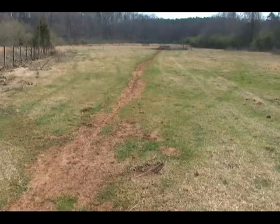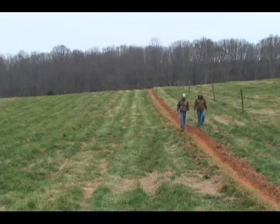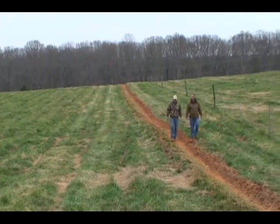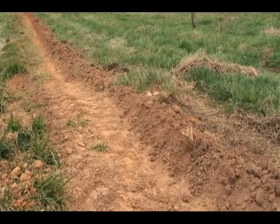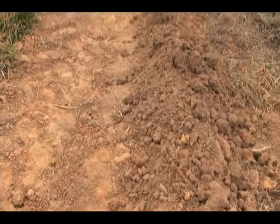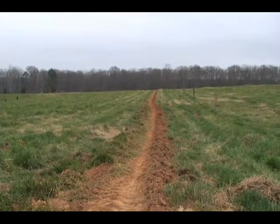It's also important to use the right material to backfill your pipeline trenches. Use mineral soils that have enough moisture so that they will compact tightly. There shouldn't be any large pieces of organic debris or manure, and any rock fragments should be small. You can crown the backfill material if you need to be sure there won't be a depression after the soil settles, and you can expect settlement to be about 10%. For example, if your trench is 2 feet deep, then you'll need a crown of 2 inches. You also need to be sure that vegetation covers the trench site to prevent erosion.